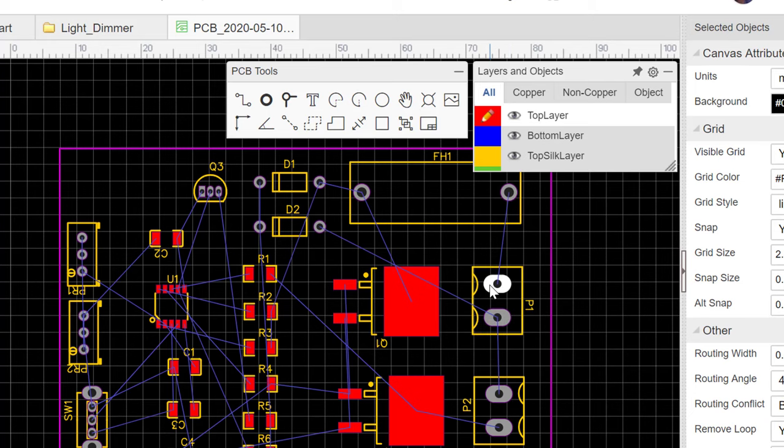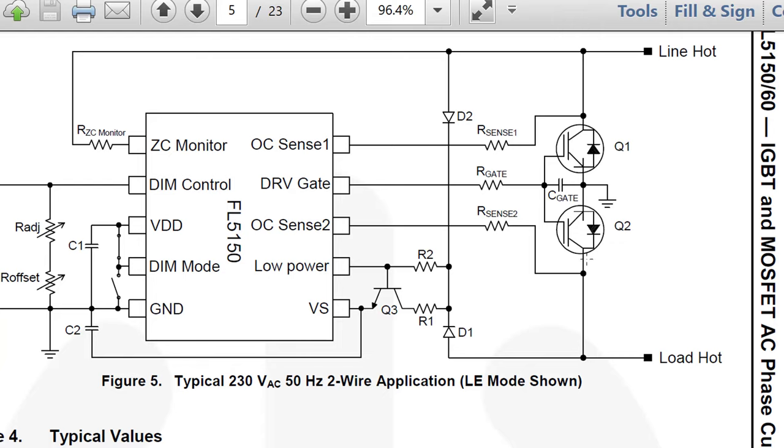So it comes in through here, goes through the fuse, and then from the fuse it gets spread across the places it should go, right? So this MOSFET is going to be doing all the hard work, or there's going to be a lot of power passing through this MOSFET. So you have to make sure that the wires that lead to and out of this MOSFET are thick enough to handle the calculated amount of power that would come through.